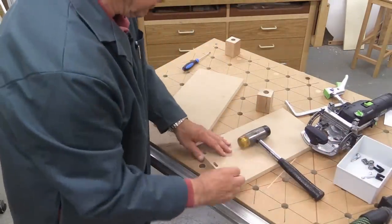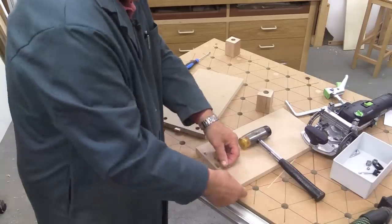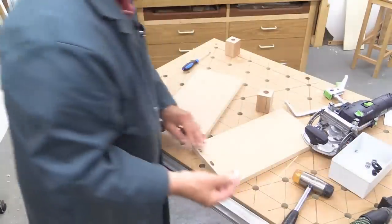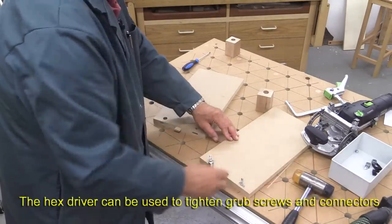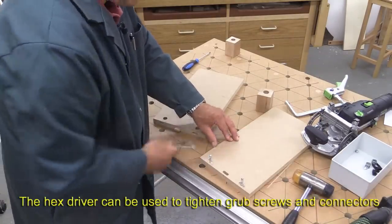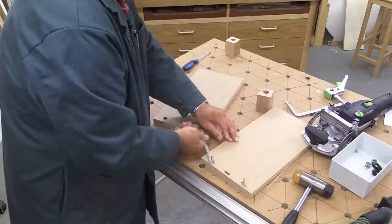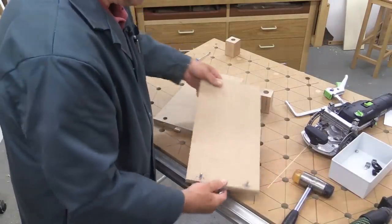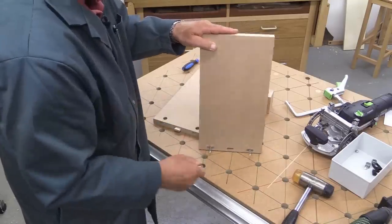these two anchors. Remember, that middle one is for the domino. And these need to be flush, like so. And then we have a pair of these. Now, as these posts are tightened, so that anchor joint is going to expand, and that will hold in the hole. Now, once one has finished this, one needs to end up with the hollow facing upwards.